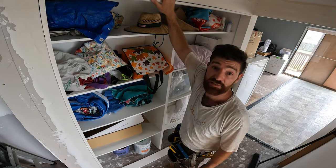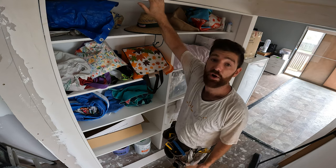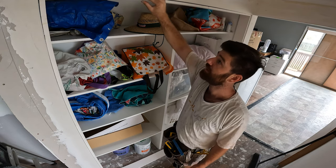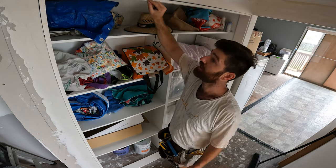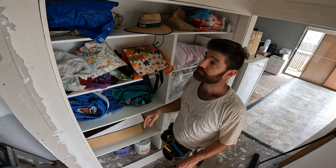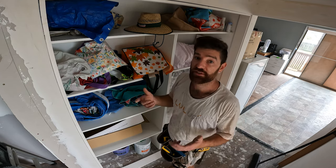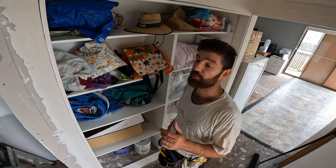Alright, so I finished off the plaster so that I wouldn't need architraves. Sometimes you can do your jam flush with the plaster and put an architrave on the front and everything's nice and tidy. But for me I finished off the plaster and I'm just going to leave a bit of a shadow line almost the whole way around. I feel like that's the look I'm going to go for — I don't want architraves on this. So that's two ways around it. We'll get this nice and even all the way along, pin it off, and then we'll put our tracks in.